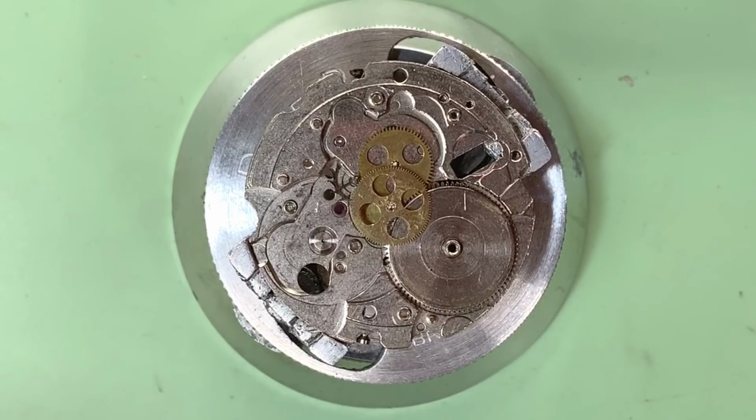That said, I inevitably fail. Certainly when I'm trying to do it on camera, I tend to think that I'm still oiling way too much, but then I think if it's your own watch it doesn't really matter that much, unless you're putting serious amounts on where it could contaminate the whole component and then get sticky with time and cause drag. If it's just a little bit of excess, I don't think it's too bad.